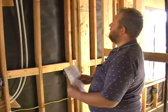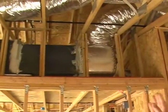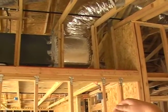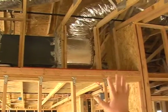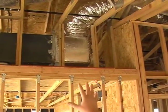Obviously, there are some places we can't get six air barriers — we'll go over those in a minute. This is one area that's going to be a problem. Right up in here, we have the sides and we're going to have the bottom air barrier against the insulation, but we don't have the top air barrier. So we're actually only going to have one, two, three, and four with the drywall — only four air barriers. This is a real problem.